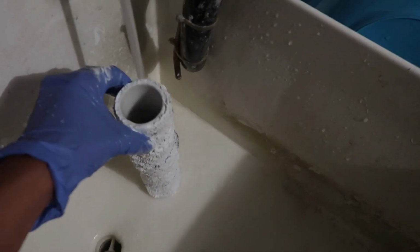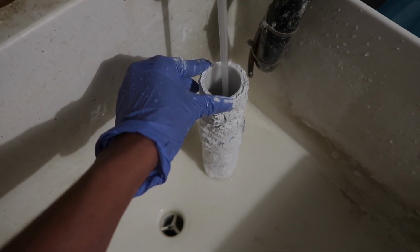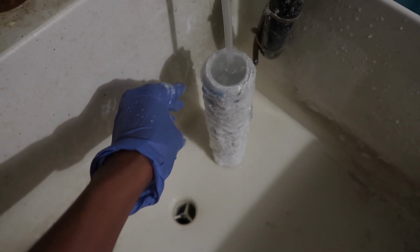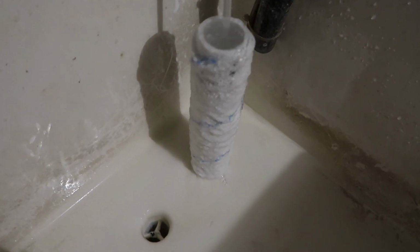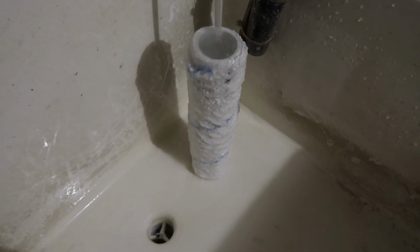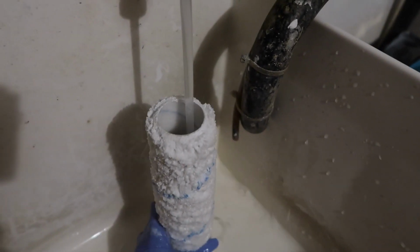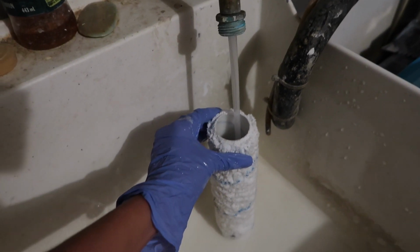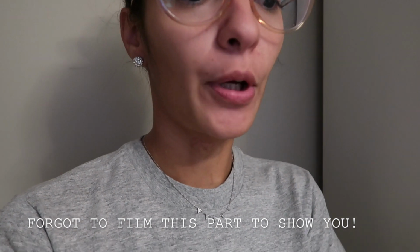And once I'm done that, I'm going to place the roller down flat on its side and let the water go inside and create a fountain that's going to rinse the whole roller evenly. I'm going to leave it there for a few minutes until the water's looking a little less solid and a bit more clear. We're also going to do the same thing on the other side. We're going to flip it after fluffing it up a little bit once again, and let it rinse for a few minutes on its other side in order for the water to come out clear. Once that's done, I'm going to put it back on its roller cage and spin it